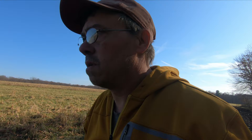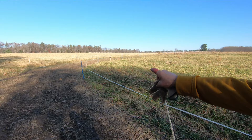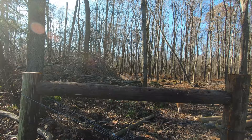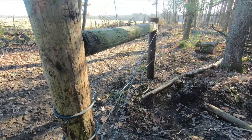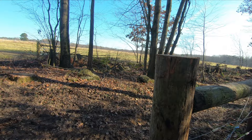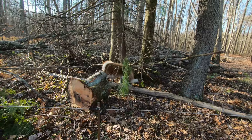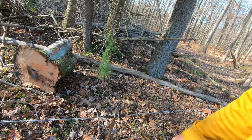So what I'm doing is moving a permanent run up into the woods where I don't have to set this fence — I set it at least five times a year. It only takes five to ten minutes but you times that by five, that adds up. I ran out regular treated posts and I'm using telephone poles — had a few extras laying around. I put an H-brace here, it's probably a little overkill for just two wires, but at some point I'll go ahead and put this in a six-wire fence. For now we're running two wires, with a sucker rod and four-inch bin tube insulator tied onto the post.